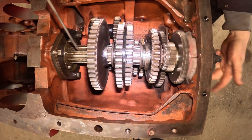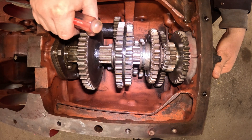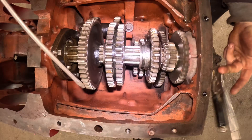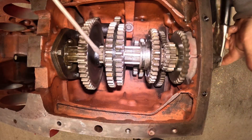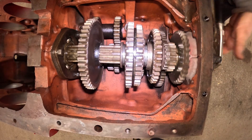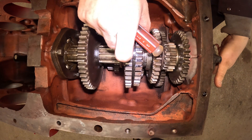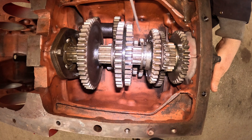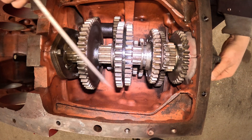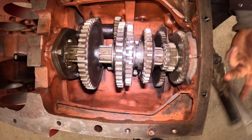To achieve first gear, there's a shift fork that engages in this slot on the gear. Each one of these three gears has the same slot. When you shift the transmission into first gear on this Farmall H, you actually go all the way to the left and pull it back — you're actually pulling this gear forward into a gear down below on the counter shaft. As I start to rotate this, you'll see the difference in speed: the input shaft is spinning at a much higher rate than the driven gear or the main shaft — that's first gear. In second gear you'll see the main shaft has picked up speed a little bit. In third gear the main shaft picks up even more speed. In fourth gear, the same theory of operation applies but it picks up even more speed.